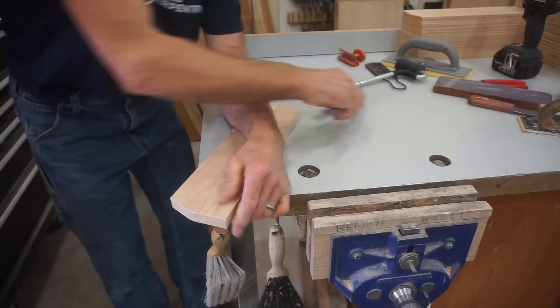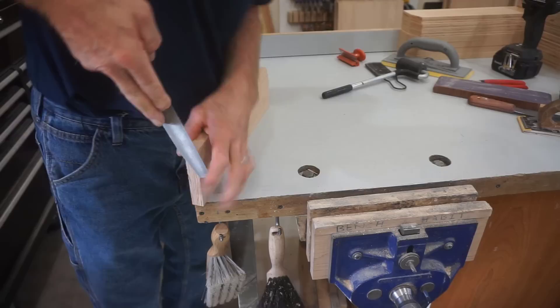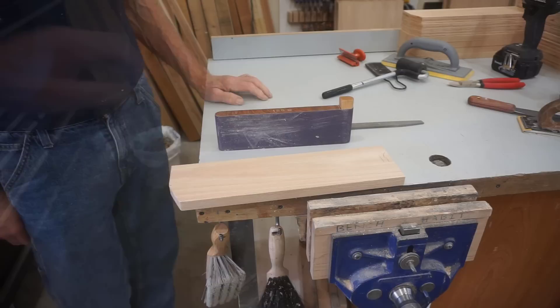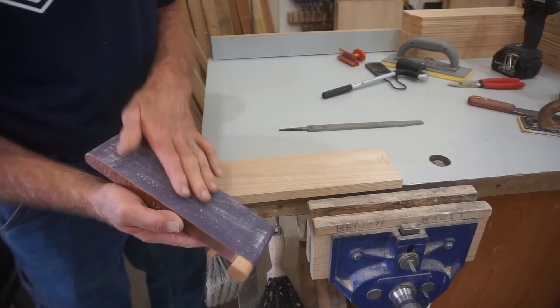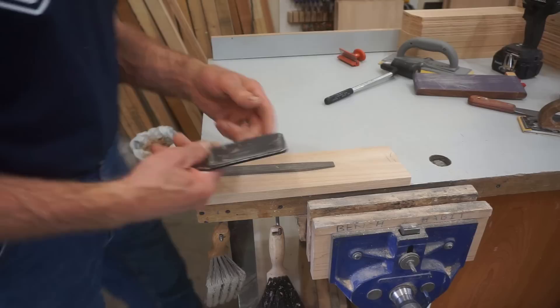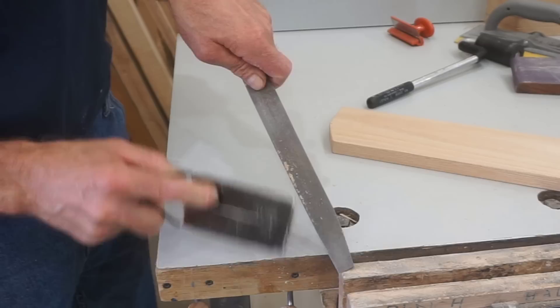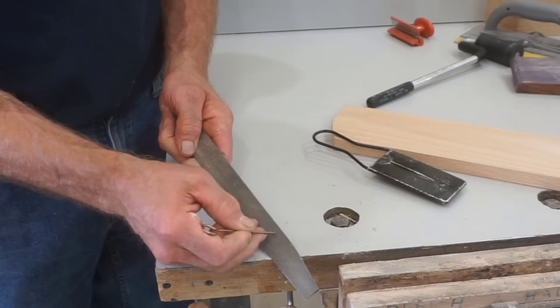I can take the ends down with a file in a couple licks. And that shows you how a block like this is handy for this sort of work. The reason I don't use the sandpaper — even though it's stiff and hard — for cleaning up the edges is because it tends to really clog up with glue and it's harder to clean the sanding belt than the file. I keep this file card on hand — that'll clean out the pores of the file quite nicely when the glue builds up. This even has a little pointed pick on there if some of that stuff really gets jammed in the file. This is good for cleaning any file, but these in particular.